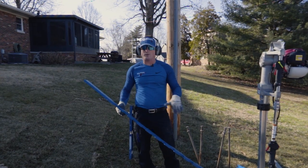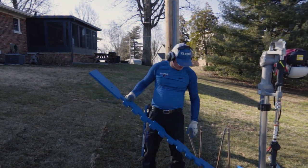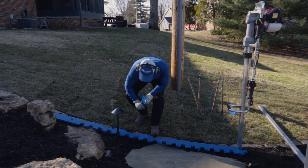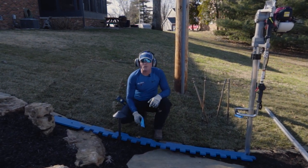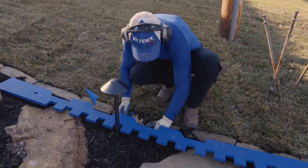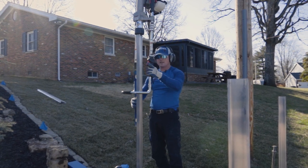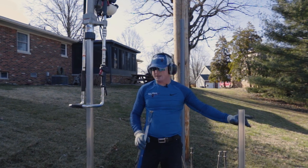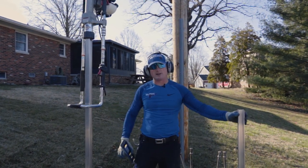We've got a four-foot gate here, so we're going to use the four-foot gate spacer. Put the post right there — it's going to leave you with a four-foot gate opening exactly. One quick tip: this spacing jig is made for a four-foot opening, but we have to sleeve this post and this post with an 065 aluminum post.